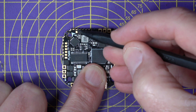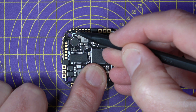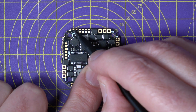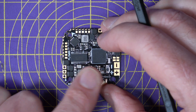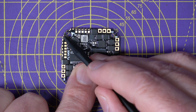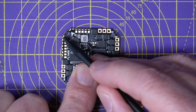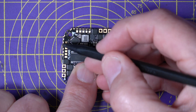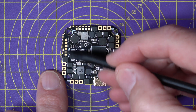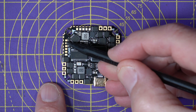This last pair here is 4.5 volts and ground, which you can use to power receivers. Then there's 3.3 volts for Bluetooth or something else. On the corner, either side of the mounting post, are your I2C connections — SCL and SDA. Then there are two more rows of pins, inboard and outboard, and running down the inboard ones you've got UART5 with RX and TX.